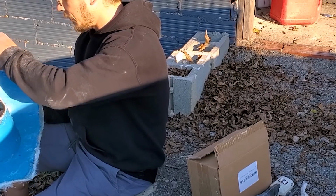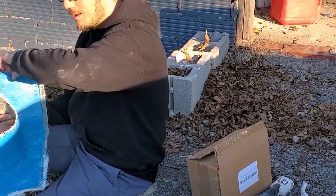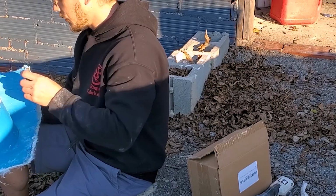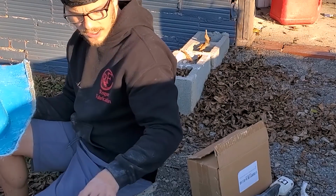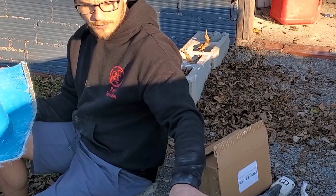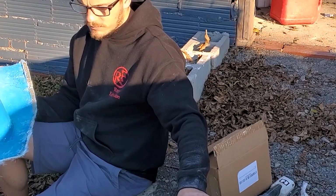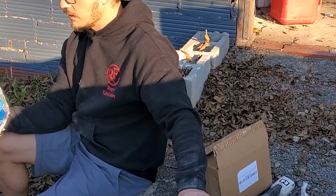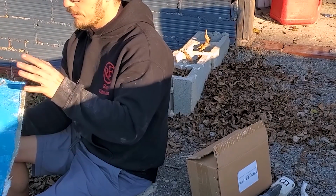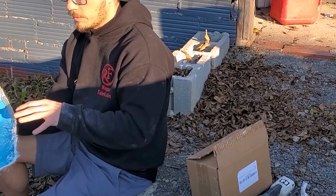I'm gonna ask some friends that do fiberglass on Instagram and see if that's the case, how to build it up thicker, all that cool stuff. But this one doesn't look very good. I expect this one to look better, still not perfect, but better. But I've got to decide now, do I remake this piece again, lay gel coat on thicker and do that and make the flange and all that stuff? Or do I try to repair what I've got?